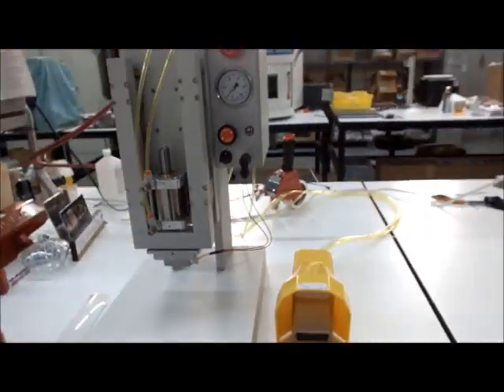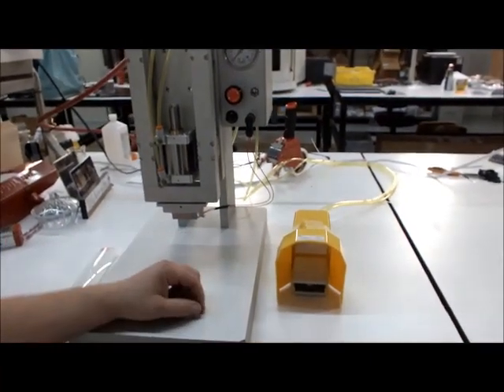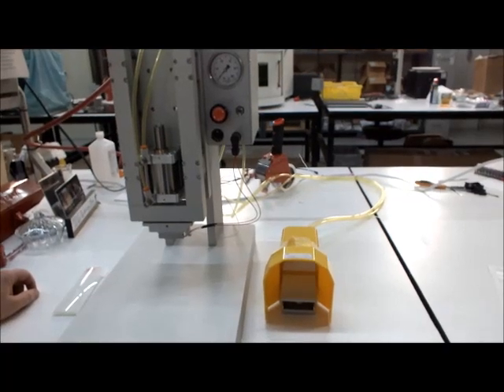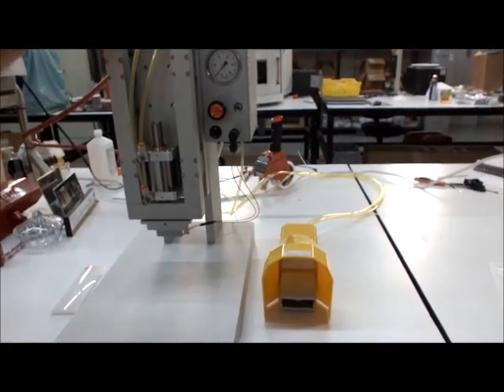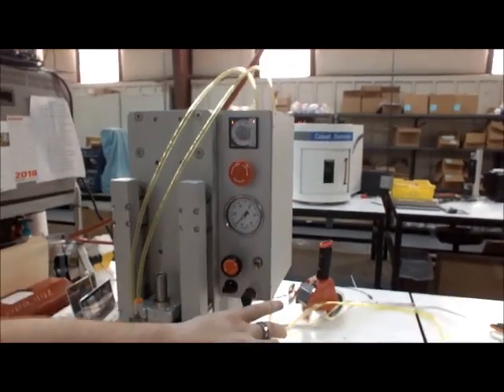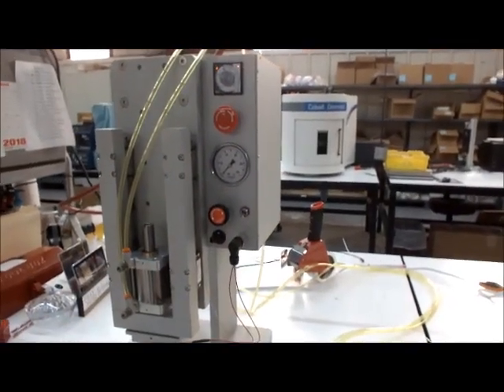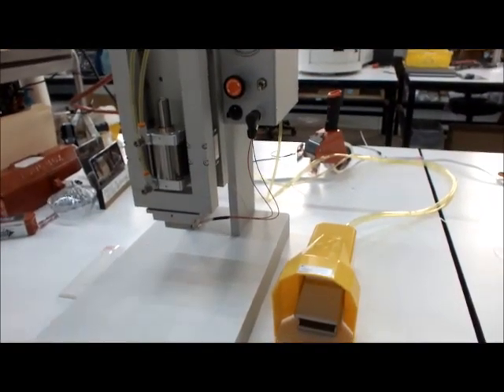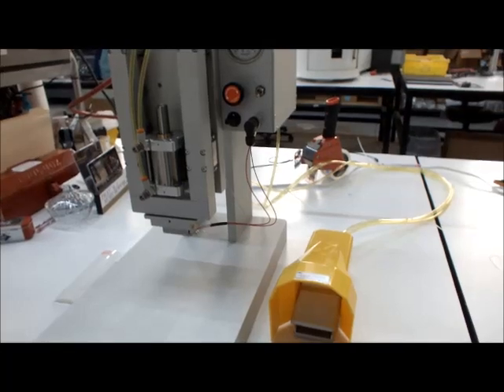When you're running a bonding cycle and you want it to cool off before retracting the head, just flip the heat off if you need to. This unit stays on when you do that, but it just cuts power to the output so it won't heat up anymore and it'll cool off. These thermodes take about 20 or 30 seconds to cool down in ambient air.